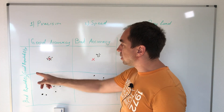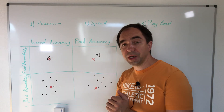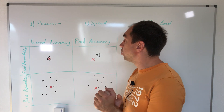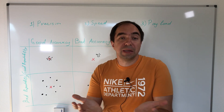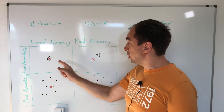For the robotic arm, it's important to have good repeatability. Because if your repeatability is good but the accuracy is bad, you can always recalibrate your robotic arm to achieve good accuracy. But if you have bad repeatability, it means your hardware is bad and you cannot do much about it. So let's check the repeatability of our robot.